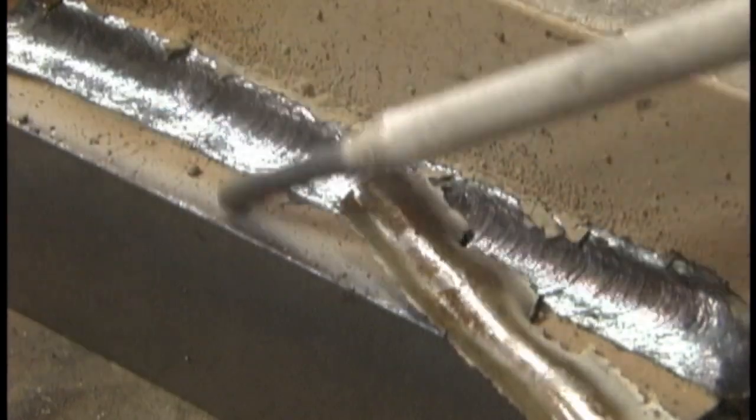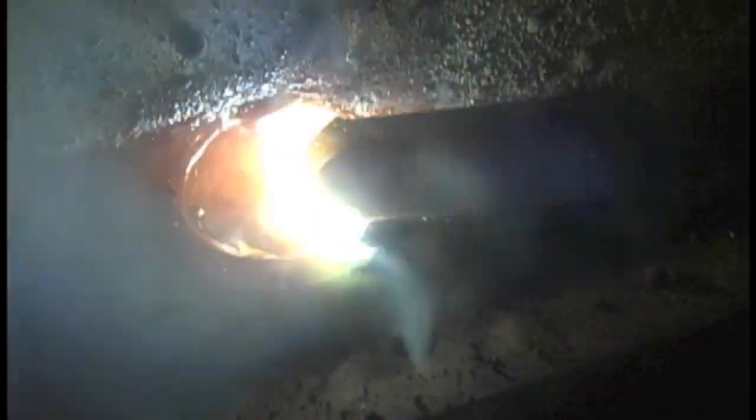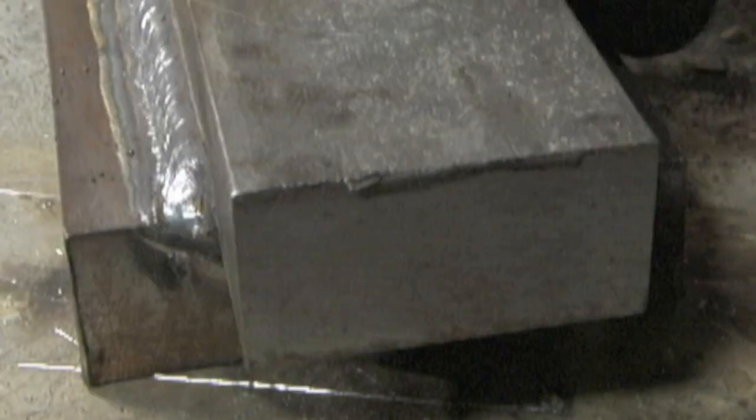This machine, even though it was set at about 135 amps, seemed just a little bit — just a few amps hotter. All machines are a little bit different, got a little bit different personality. Now I'm alternating direction again, going the other direction with that last bead. And that is the finished fillet.